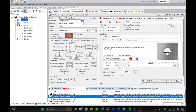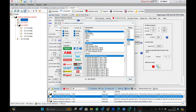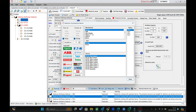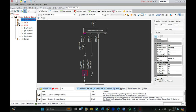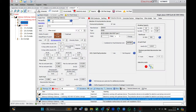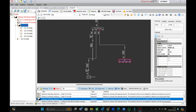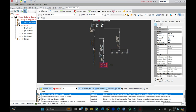I did make a mistake in not setting the actual PV inverter as a solar generator, so we're going to go back and adjust that in a minute. But for now this is the AC-coupled Give Energy all-in-one, and you can choose your particular circuit breakers for that product. In this case they are ABBs with a tied-on RCD, so you're taking up four ways within the enclosure for each singular circuit. We're going to set those to the 32-amp rated device. We're going to choose it as a renewable source and set it to 6 kilowatts. Weirdly, they are type AC-RCDs within the first version of the gateways — they've subsequently changed and are now type A's. But we're going to set it as we have it; this is some old stock that we've got in the business that we're not using, facing issues with installs due to the fact they are type AC-RCDs.